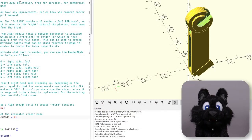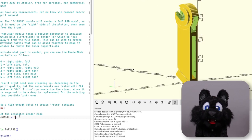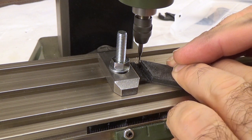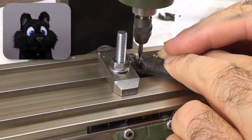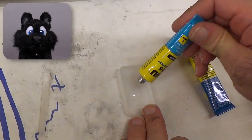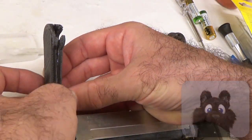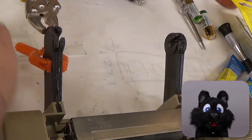I made an OpenSCAD model of the paper roll holder. They are mirrored versions, so I can use a negative one scale to create the other. I'm cutting them down in the middle to compensate for any warping in my 3D print. After printing and sanding, I glued the two halves together and spray painted them. And yes, I made two, so it wouldn't be as obvious that there is a replacement in there.